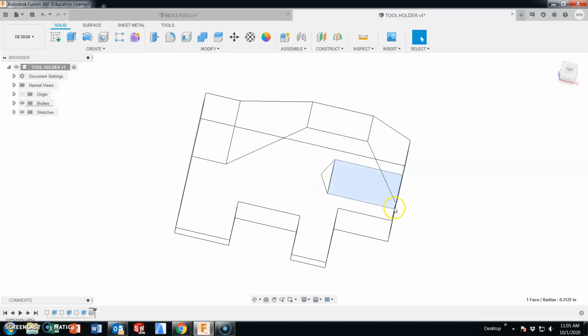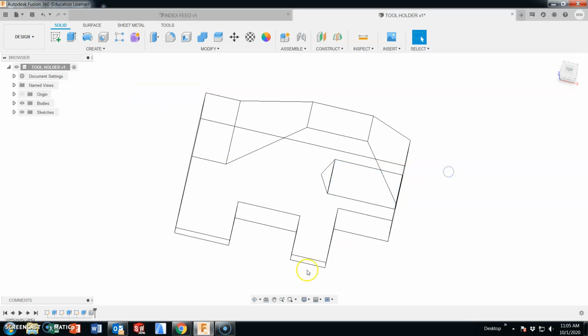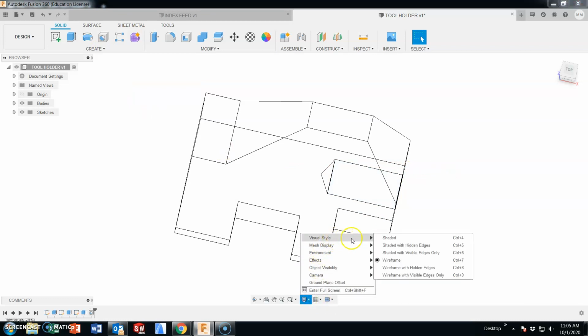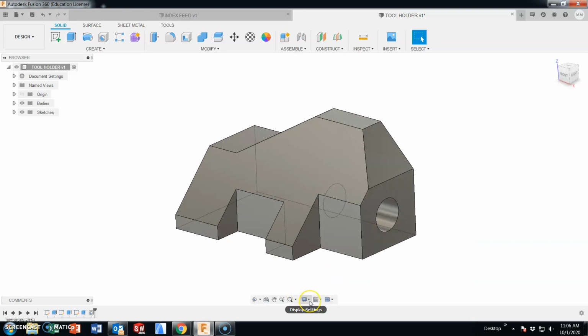The diameter is pretty straightforward, 5/8 of an inch for this one, but the depth is measured from what's known as the shoulder, where it goes from being cylindrical to being conical. So in this process, we do need to use the hole tool. So we'll take a look at creating this one, start to finish, but really concentrating on the drilled hole in the end.